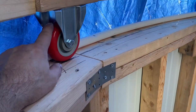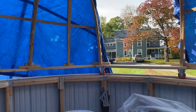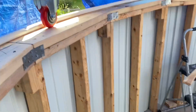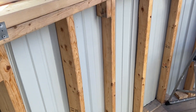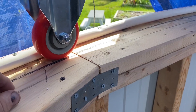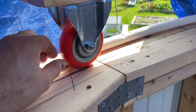I was advised to get metal wheels because they would last longer, but because I live in an area with houses nearby, I didn't really want this to be squeaky and very loud at night. It sounds loud on the video, but a lot of that is the walls vibrating and the wheel traveling over these joints here. So I'm going to put some very shiny Masonite material on the surface, which I think will cut down on the sound when it goes over these rough patches. It'll also help if the wheel needs to play in and out a little to be guided — it would help if it was on a slicker surface.